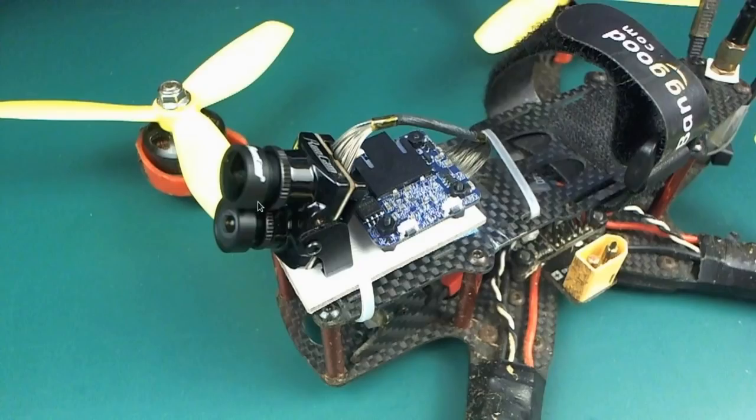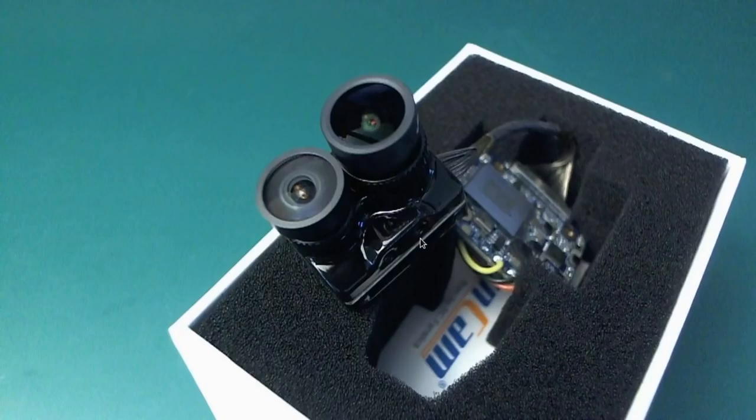So one of the reasons for doing this thing with the separate cameras, I should have mentioned at the beginning, I think the reason that this is being done now is because the FPV camera needs to have very low latency, at least if you want to feel confident like a boss when you're flying around instead of a fumbling noob. And the amount of processing that the HD camera has to do is quite intense, so I think it was beginning to slow down the latency that was able to be achieved if the FPV output was coming through the HD camera. Maybe something like that, I don't know. But anyway, this seems to be the trend, and it's fine by me. It seems to work quite well.